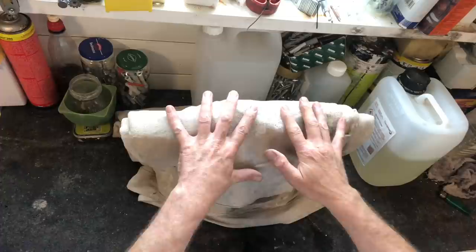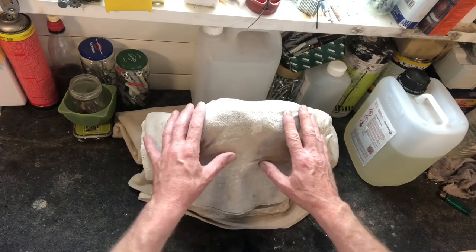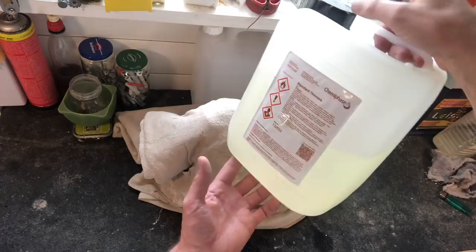And bear in mind, when you've finished with this project, the cellulose thinners you can still use again, so put it in an empty terps container or back in an empty one of the containers that cellulose thinners comes in. Simple as that. Right, so that's what I do. Stick them in the jars, get cellulose thinners in there, leave them for about 24 hours. And I'm going to come back and show you the procedure of how I'll restore these brushes. So see you in about 24 hours. Let them have a good soak.